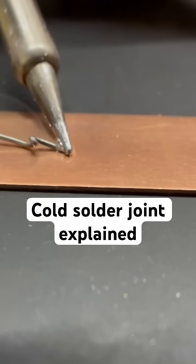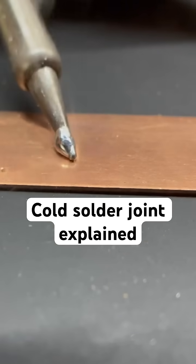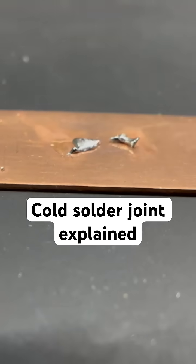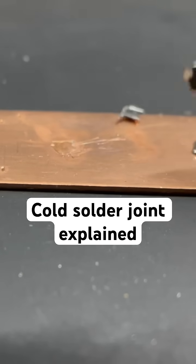I'm not going to create a new alloy right now. I'm just going to get solder and smear it over the surface of this copper plate. What's going to happen is there's not going to be enough bonding — there's no mixing of the solder and the copper. So there's really no good, strong, physical, mechanical connection that takes place. To illustrate that, let me take a screwdriver and just scrape that solder off. That comes off super easy — I barely have to push on it.